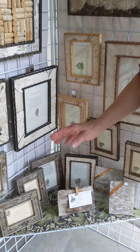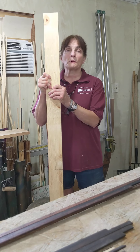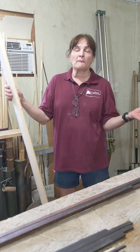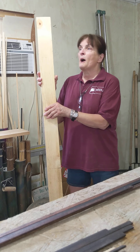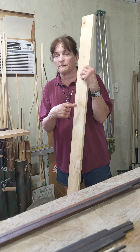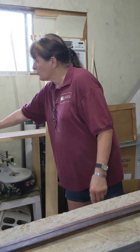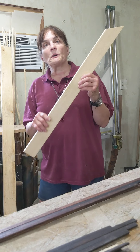So anyway, this is what I do. Cody, my cameraman, why don't we step over and show the folks the first step. Okay, this is where it all starts. When I lived in Minnesota near Two Harbors, I knew some contractors and they used to give me their scrap lumber — perfectly good 12-foot-long pieces of 1x4 or 1x6 used for bracing. But I'm not in Minnesota anymore, so I have to rip the board to the width of whatever frame I'm making. Right now I'm making 8x10s, so I've ripped it to 2½ inches, which is the width of the 8x10 frames.